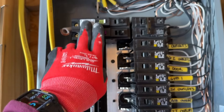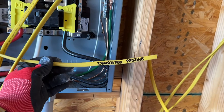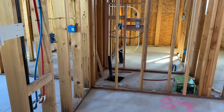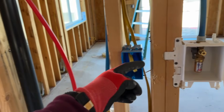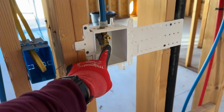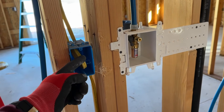Now when we come over to here, I'm going to be wiring in some other circuits that don't have the opportunity for a GFCI plug, or it's a single plug and I don't want that first plug to be a GFCI. For example, I have a dedicated fridge line — this one will be one outlet just to the fridge. Right here is going to be our outlet; it is a single run straight to the garage. Imagine you have your fridge in here and you have one outlet that's GFCI, and for whatever reason it trips. The only way to reset it would be to pull your fridge all the way out, possibly remove your water line, push the button, reset your circuit, and push your fridge back in. That would be a huge hassle. This does need to be protected by an arc fault — and how do we do that? We use those bigger AFCI breakers.